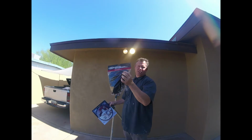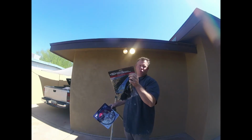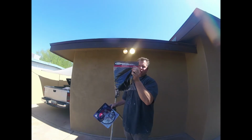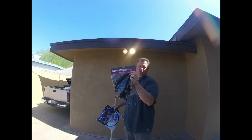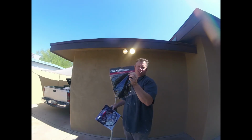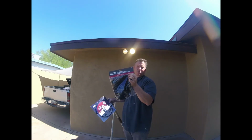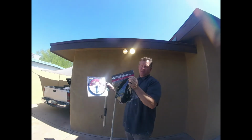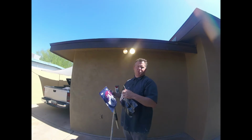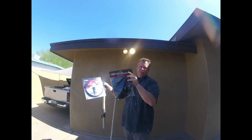Most people like to take the dust off the walls before they primer it. But I'm not going to only use this just to take the dust off the wall. I'm going to show you a trick that I just found out about using this. We're going to actually use it around the patches to get rid of edges. Most of my patches, whenever I do a spray texture, I have to take a sponge around the edges. Using the sponge technique, when there's a lot of patches on the ceilings and high walls, I have to go up and down a ladder, up and down, up and down. So I think by using this attachment with my extension pole, I will save a lot of time and a lot of energy on the job by using this technique that I'm going to show you.